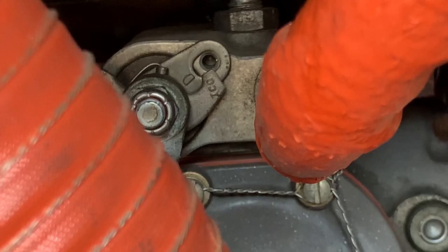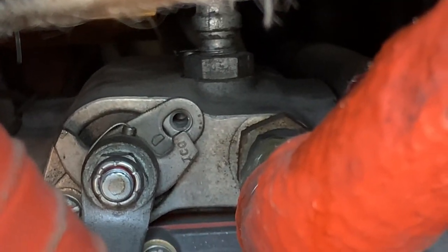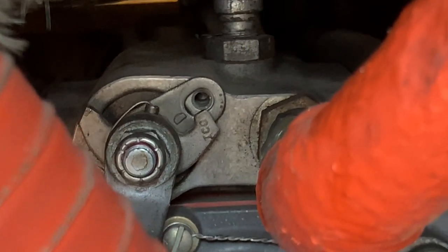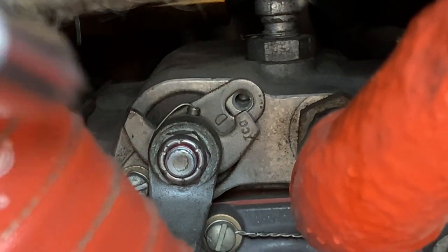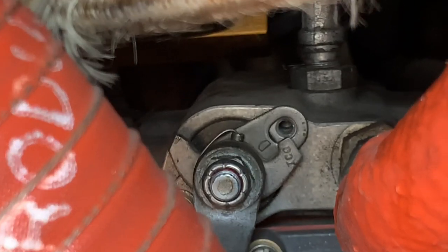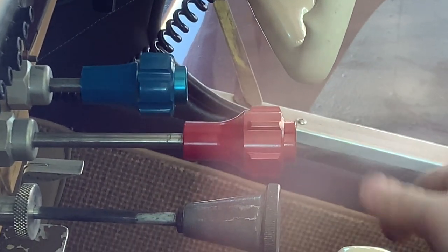Right now there's a sweet spot on the cable that kills it, but the issue is there's no set screw and there should be. The cable is in and it works, and we'll need to figure out if we are allowed to put that set screw in there, or get with Bendix — that's who makes this unit — to see what the hardware should be. There also looks like a polyurethane spacer that goes with the screw that gets safety-wired. Let me pull it out a little more so you can see how far it goes past where the stop should be.